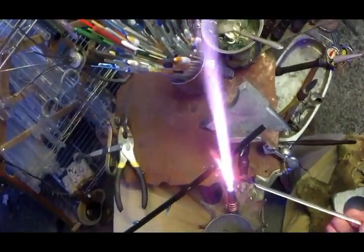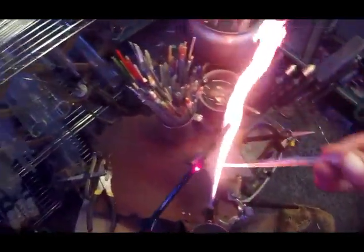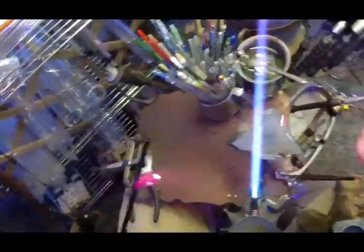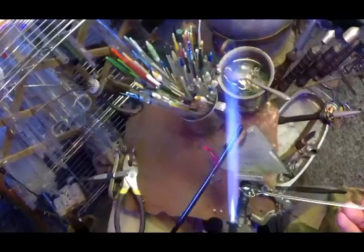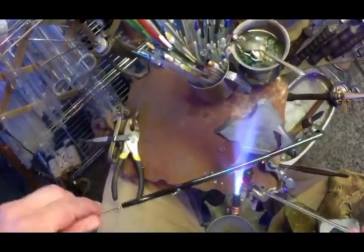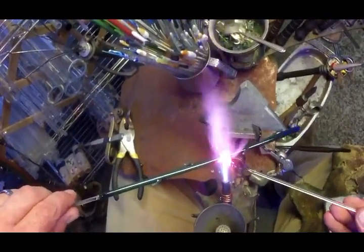Now grab our thorny stem there and weld up our leaves very quick. And again, heat it significantly through to where you've got a molten half on your stem, but time it so that the leaf is ready to apply, and when you put them together and pull them apart, your stem does not just fall apart and bend over on you. If that happens, you've gotten too much heat into the stem. And again, heat just one half of the stem very quickly. Of course it'll spread, but you're timing it so that it doesn't spread and lose control.